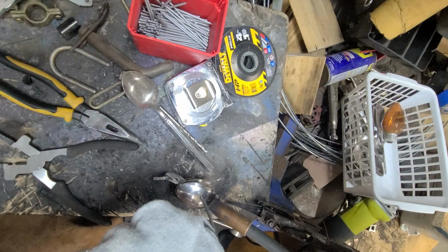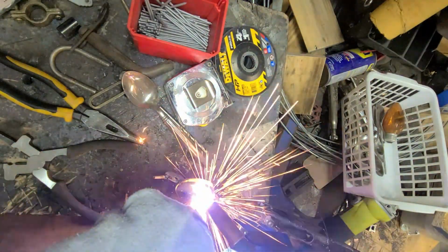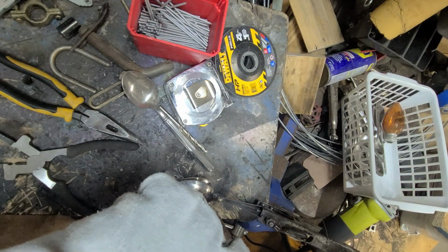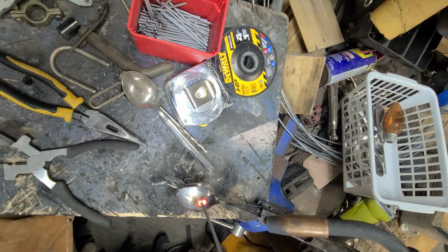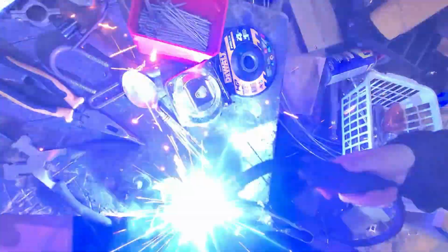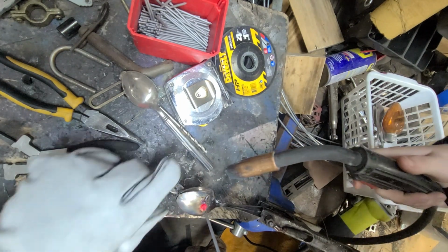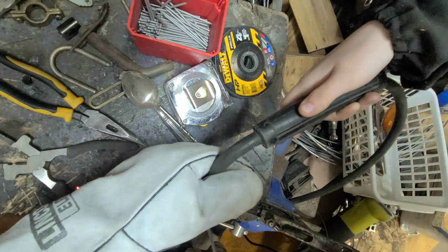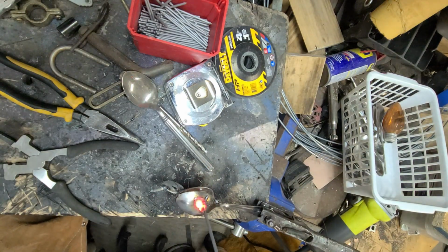Okay. Give me 4 tacks around that. You haven't made a connection yet. Nope, move it in closer. Is that good? I don't think you've made it stick. You're not getting it on the spoon. I'm not? No. Okay. Start here. You hear that consistency right there? Yeah. That's what you're looking for. Okay. Let's give me one more out here. Go ahead and hit the button. Okay, stop. You see the difference? Yeah. I thought I had to go back and forth a lot.